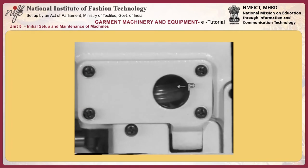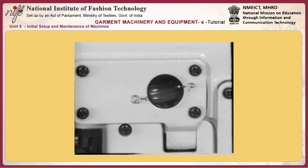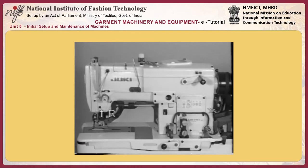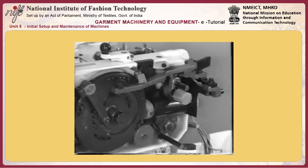5. Checking oil sight window O. Check to be sure that oil flows inside two tubes. In tube P, oil flows to the left on the lubricating side. In tube Q, oil remaining in the faceplate R circulates to flow to the right. Run the machine at a low speed and you can see the oil flow clearly.